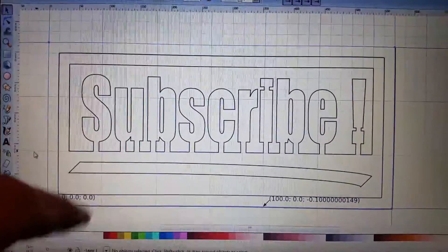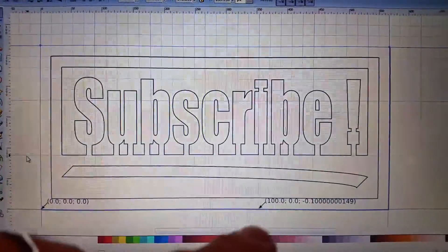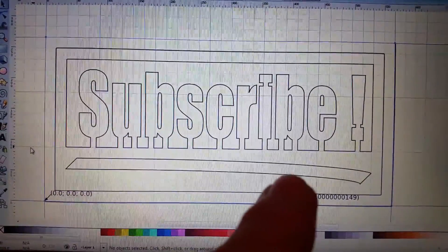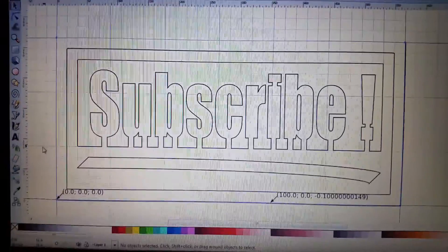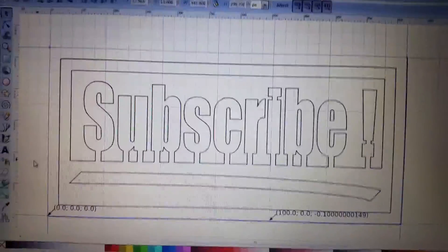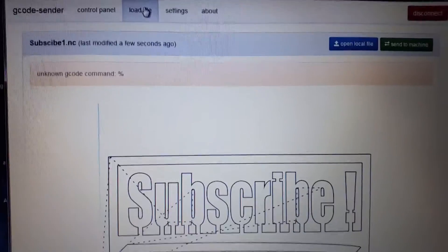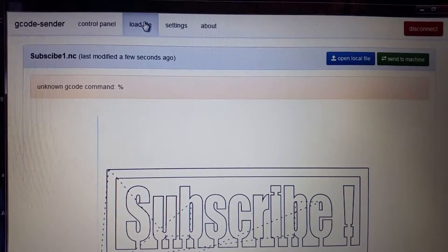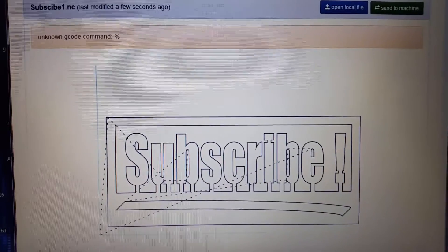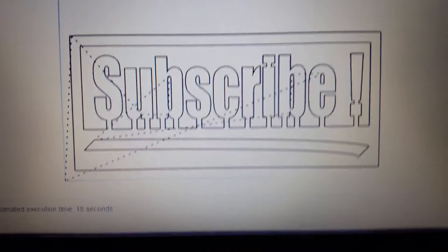Then you can attach each new letter object to the main frame — all you do is hit Control Plus for that. On the bottom I made a shape and it was Control Minus to do that. Then using the Path to G-code plugin I exported it to a simple G-code and loaded it up in the G-code sender for Chrome. It's a nice clean G-code sender — it doesn't recognize all commands but it's GRBL compatible.